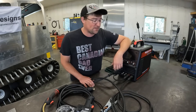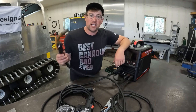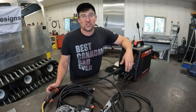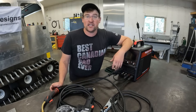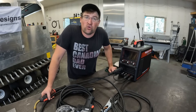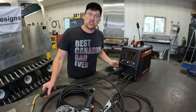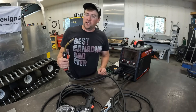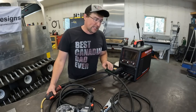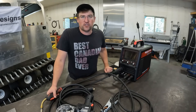One of the best features about this machine is it not only MIG welds steel but it also MIG welds aluminum without costing you a fortune. Typical MIG welding aluminum setups can be very expensive because they use a push-pull gun setup where it pushes wire at the machine and pulls at the gun, and those are not cheap at all. There is an advantage to that so you can run smaller wire and really long lead lengths. In a typical MIG setup where it only has drive rollers in the machine, pushing aluminum wire is very soft — it likes to birdcage up in the machine, birdcage up in your liner, and it just has a lot of difficulties. But with this machine, a fairly short lead length and a Teflon liner installed, it can push 035 wire and up with very little issue.